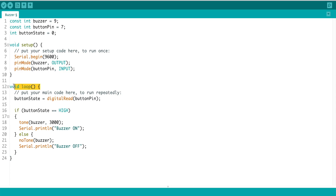In the loop function, we first read our button using the digitalRead function — this is a built-in function — and store it in the 'button' variable. Then we use an if-else statement: if the button value is HIGH, the buzzer will play a tone using the tone function. We add the pin number and the frequency value, which is 3000 — you can adjust this depending on your buzzer. A line is also printed in the serial monitor saying 'buzzer on'. In the else case, the noTone function stops the buzzer and the serial monitor prints 'buzzer off'.